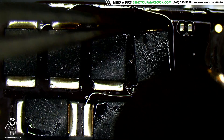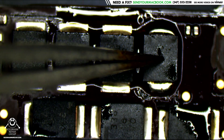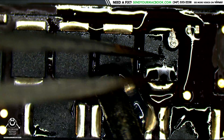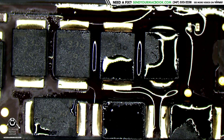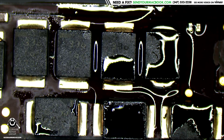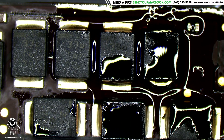One side I put solder on, I put it down, and then it's flat on the board — whereas it won't be flat if both sides have a bump. With a soldering iron, I can't hit both sides at the same time like hot tweezers can. So that's why I put solder only on one side, not both. I've pushed it down on the board. There's going to be a little bit of excess solder under there — I add some flux and use my iron to get that out. Beautiful.